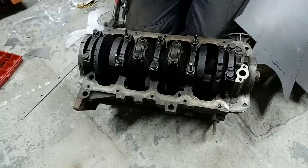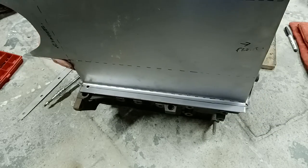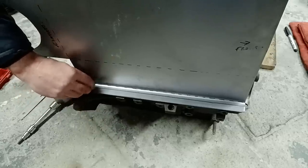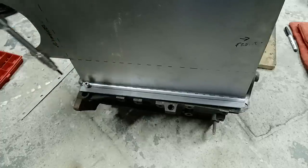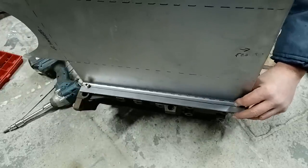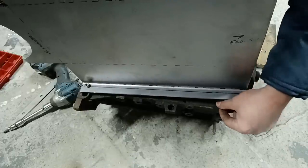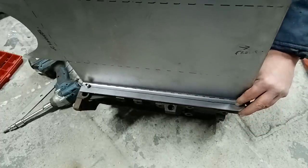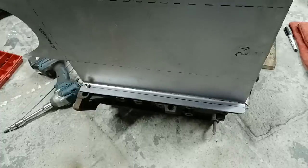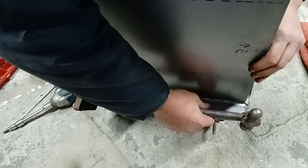Right, so I've turned the block around so you can see what I'm doing. Starting from this side, which is the flywheel side, I drilled my first hole because I can eyeball where that's got to go. So I'll drop that into place. Loosen. Work out where I'm going on this, backwards or forwards. I've got my transfer screw in this side, and then we'll tweak it down into place. Looking good. And then just tap that onto the screw without moving it.